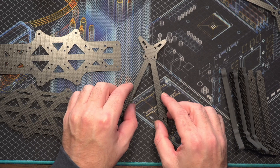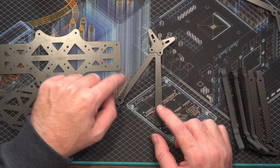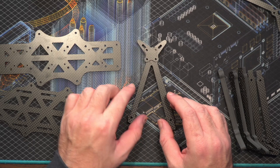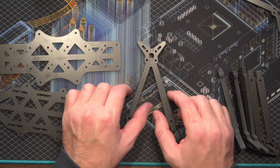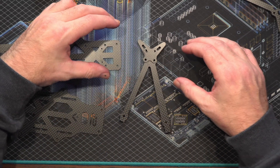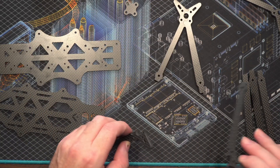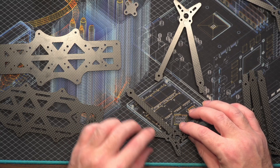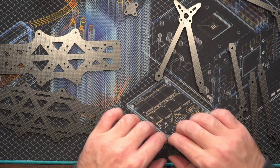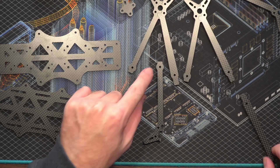If you were using a single-arm design piece you'd have to choose either one direction for the carbon fibre weave, leaving the other off. So it is an interesting design — you have this interlocking arm assembly, then the motor bolts go through the plate into the motors themselves, locking it tightly. The strength for that is all in that joint. We simply choose our matching pieces to lock them together — one with a round base and one with a square base.